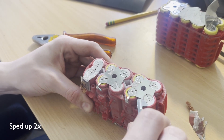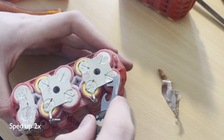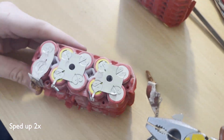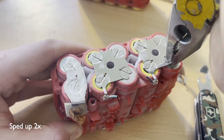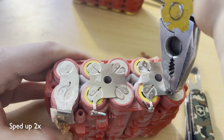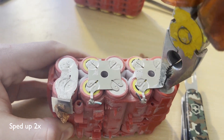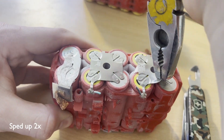If there are no large tabs, which is the case for most of the battery, you can wedge something thin, like a pocket knife, between the tab and the cell, just enough to lift a little bit. Then grab it with pliers and slowly wiggle it back and forth until it breaks free. The biggest thing here is take your time. We don't want to puncture, crush, or tear the batteries at all, as this could lead to a thermal runaway.